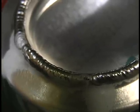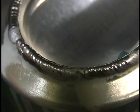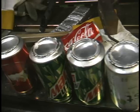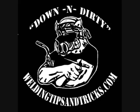Now I'm trying to just pile up and run a cold bead — just barely enough amperage to flow the metal along. Try to keep that rod fed in the puddle, keep the puddle satisfied with rod so it won't draw too much base metal and penetrate too much. So here you've got the Everlast PowerTig 250EX and the Miller Dynasty 200DX side by side. Not like night and day, but they are a little different.